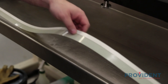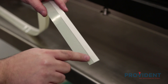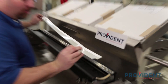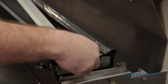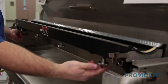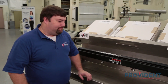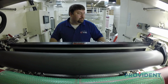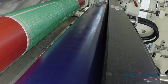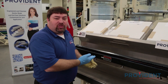We're now going to install our containment blade system. This is our Mylar containment blade — it features the TCS system, which is this notch here, as well as the RX seal. The foam seal goes into the chamber, as before, and the blade is fully seated in the blade holder. We tighten from the center out. I'm now going to install our built chamber into the PCMC press. Now our chamber system is installed and we're going to begin our press run. We've now finished our press run and I've removed the chamber from the press.